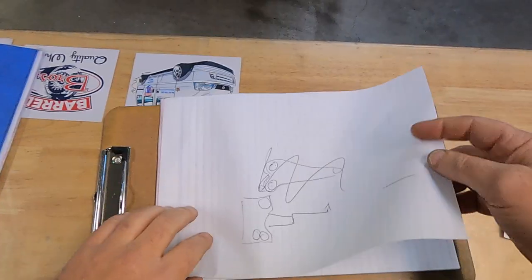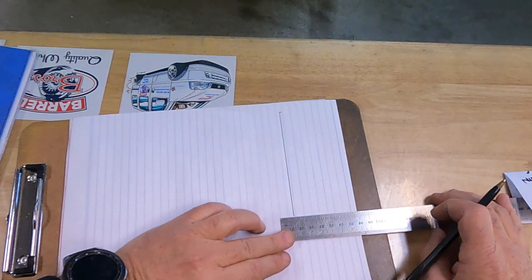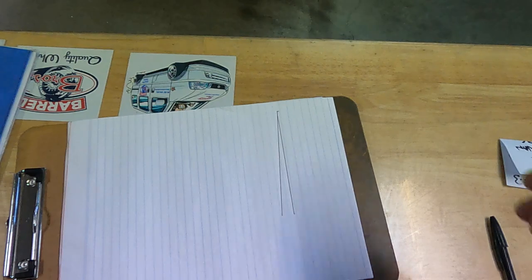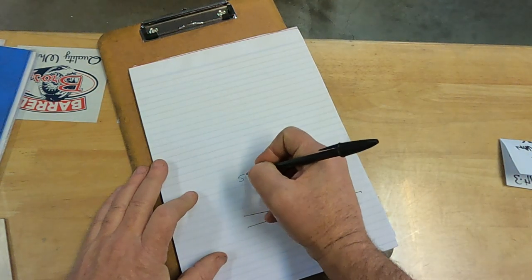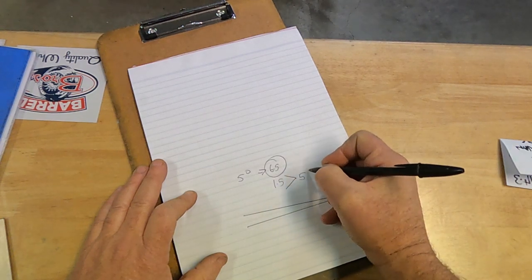I've been downstairs and I've measured up the arm and the re-drilled bolt hole. I'll do it out on paper and we'll see what sort of figure we can come up with. The important part is: the centers from the top to the bottom is 124 millimeters, and the new bolt holes are drilled 13 millimeters back. Let's find out with yonder protractor shall we. That's the tilt that we will get - put that along about the center and come down 6.5 degrees. So we need around about five degrees and this is going to give us 6.5, so 1.5 degrees off is better than five degrees approximately.